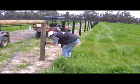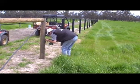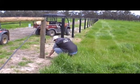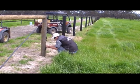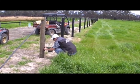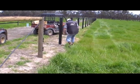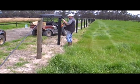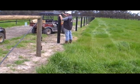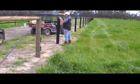Once the rail is being paid out and you put it into the bracket, then you would put the second screw in. If you're using the traditional horse rail, the non-electrified version, then you'd probably use the metal bracket, in which case it doesn't have the clip system as in the hot top bracket. Here you would put the bottom screw in, allowing you to clip the rail in and let it hold itself up before you put the top screw in. We use rechargeable drills these days, as you tend to get a couple of hundred screws out of each battery.